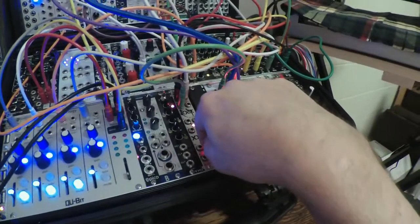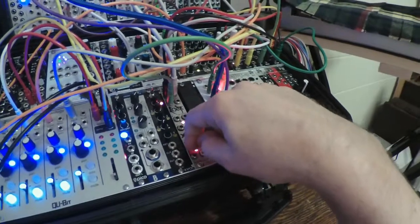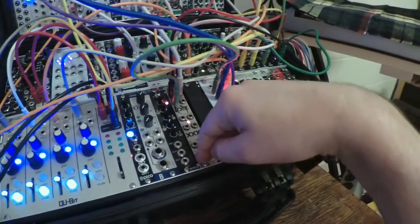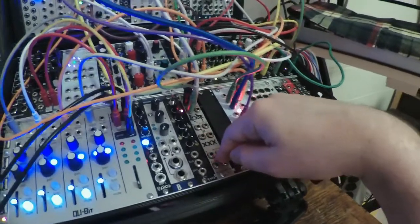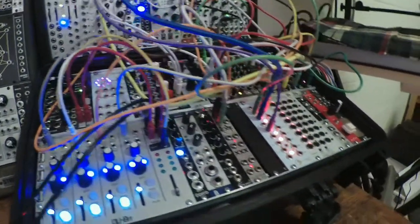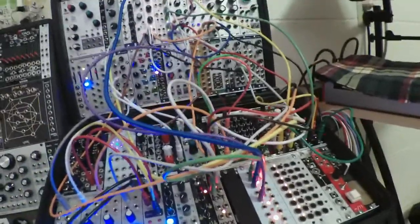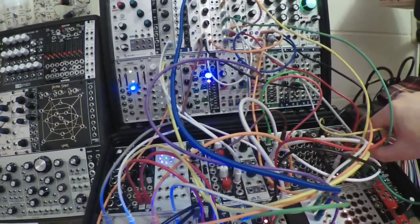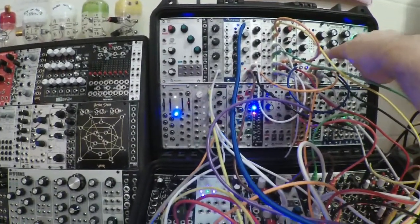And it also has an interesting analog XOR, which supposedly passes input A through to the analog output, but when input B is high, it gets inverted. I think it does more than that to the signal, but we'll hear it momentarily. Right now I have a pretty mind-bending patch going on that I thought of in the middle of the night using Plaits speech mode.